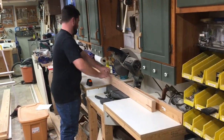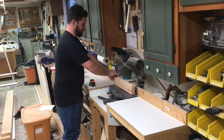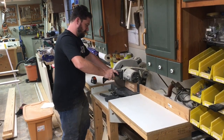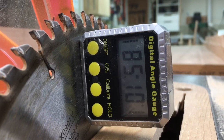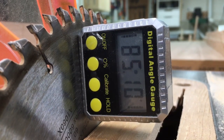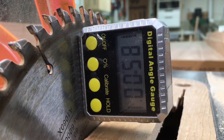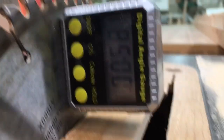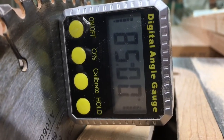This is my son who designed the table, and we're starting off by building the frame of the table itself. We're using two by fours to cut and make this frame. The interesting thing is we're going to be cutting these at an 85 degree angle — basically five degrees of an angle — and everything is going to be related to this five degree angle. The frame that goes around the top of the table as well as the legs are all going to be beveled at a five degree angle.